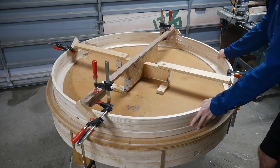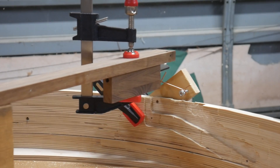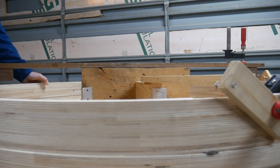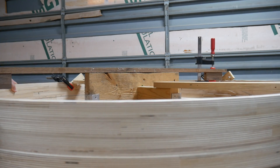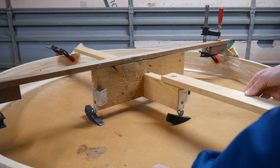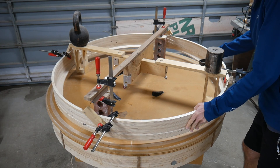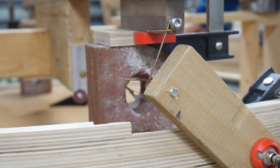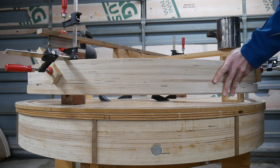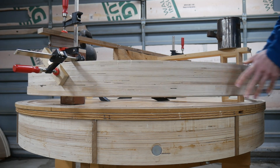That's encouraging, but before I commit to all those extra parts, what if I simplify and just put the ramps midway out and constrain the rotation with links? It's not great, but before I give up, let's try it with better ramps. That was not very compelling. Let's use this same setup to test suspending the skirt from links instead of using ramps - this would be much easier to construct, although I'm not super hopeful about it. It looks like 30 degrees is maybe the maximum angle, and even then I'm sort of helping it out to get the vertical. So this one has no legs.